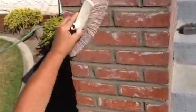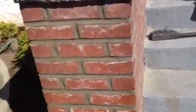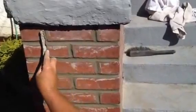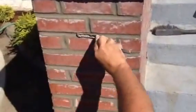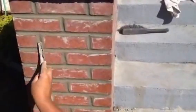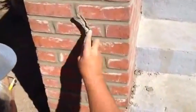After that, you take a brush and go at a 45-degree angle — much like you're grouting a tile — always pulling upward to pull that excess mortar off. Some people use a piece of carpet. Then you go over your joints lightly and retool the whole deal, so you've got a nice steel finish on that joint. That'll keep the water out and make the joint last much longer.